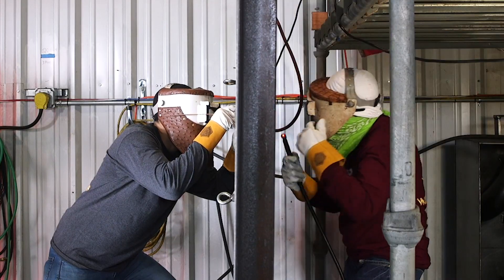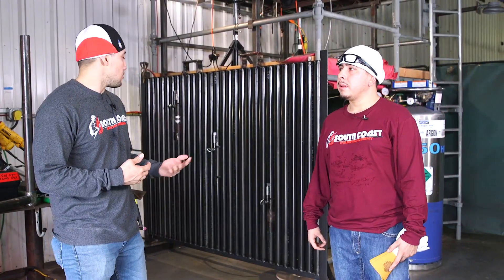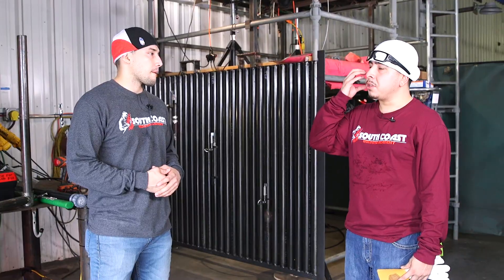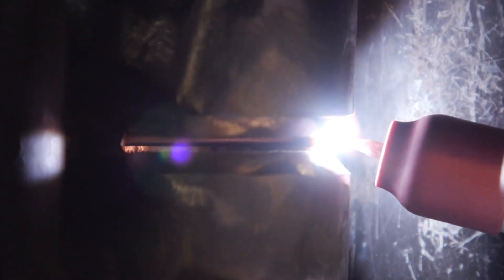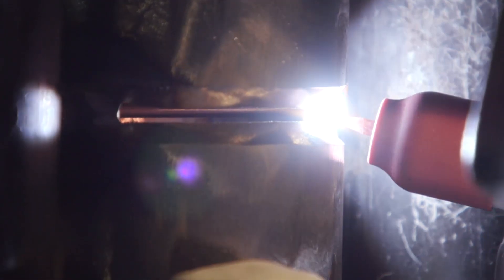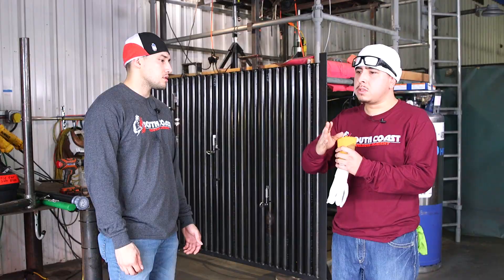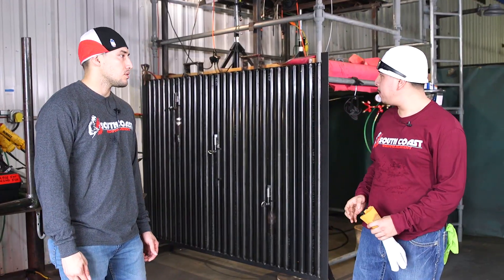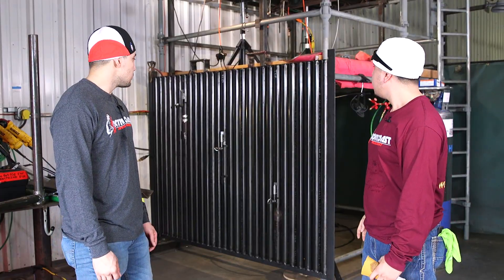So what's the difference between pipe welding and tube welding? Do they ask for different penetration on the roots? It usually depends on what side you're working on. On the union side, they usually ask for no push-through — they want a flush root. The reason is that on these water lines, too much push-through is going to cause turbulence, corrosion, too much erosion in the pipe, and it's going to throw up too much vibration and throw off the tubes.